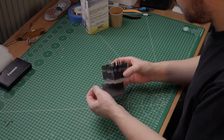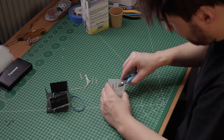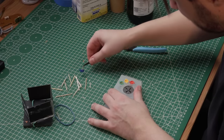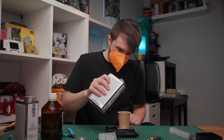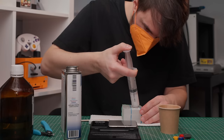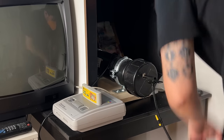Now back to the silicone mold — it should be ready. So I remove all the vent sprues and then gently try to separate the two-part mold. With the original buttons out of the form I quickly mixed up some resin, added some color and sparkle to my liking, degassed it, and put it in the closed mold with a syringe. Then it goes back in the pressure pot to make sure no bubbles are forming.